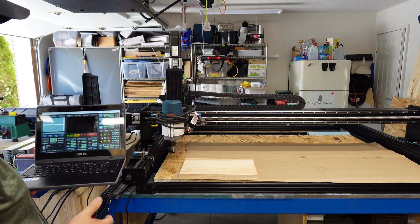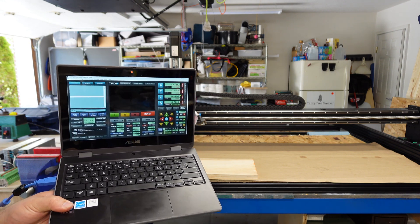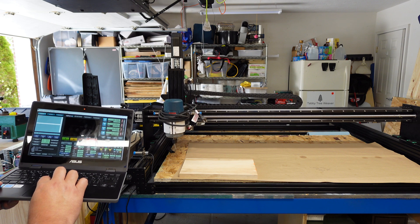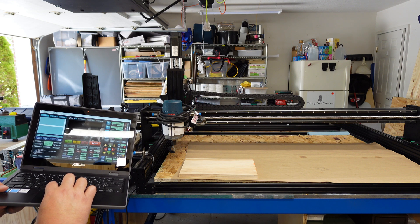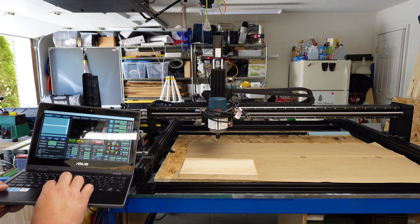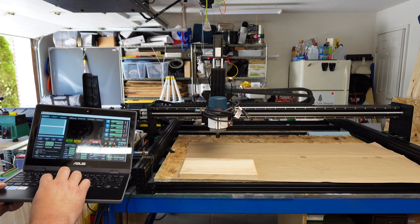So I've got the Yang Yang CNC actually moving around. You'll see here that I've got Mach 3 — I do have the 1024 dark screen set, which I really like. You can see I can jog it up, jog it down, bump up my jog speeds. I can probably still play around with the speeds a little bit — I think I can go a lot faster than that. And then you've got your Z up and down. I did hit my limit there, so that worked — did what it was supposed to.